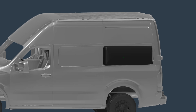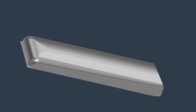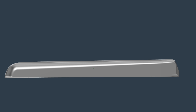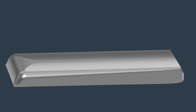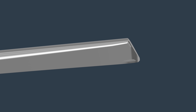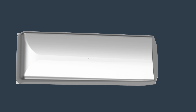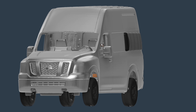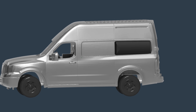After we have all the geometry, the next step is design. For this, you will need to know CAD, but this is a pretty simple design. I extruded out from the perimeter and added some fillets to smooth it out. The front edge gets one big fillet to smooth out the airflow. I got a little fancy with the rear, trying to angle it in while keeping a somewhat sharp edge on the back. This will help detach the airflow so we don't have too much added aero drag from this thing. I considered running an aero analysis on it, but then I remembered I don't care that much.